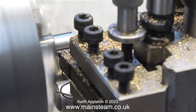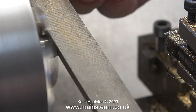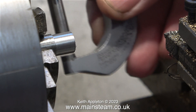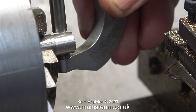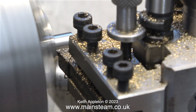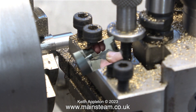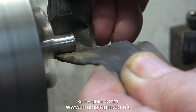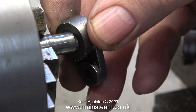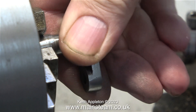Once I've turned the part almost to the finished diameter, I used a file to clean up the front edge and the edge on top of the crankshaft part. Time now to use the micrometer to see how close to three-eighths of an inch the diameter is. Another longitudinal cut and another check with the micrometer — it's very close now. As I've mentioned before, I'm not an engineer, so I don't have a problem using wet-or-dry sandpaper for what is in effect the final cut.